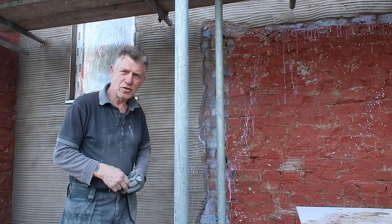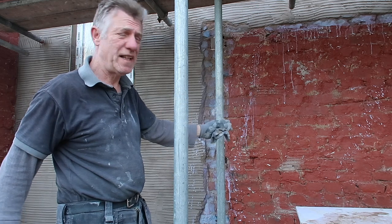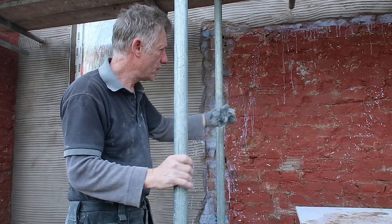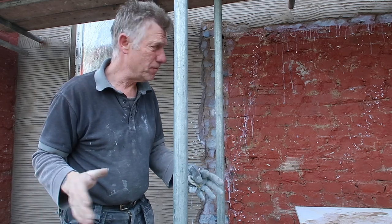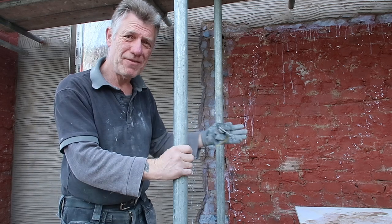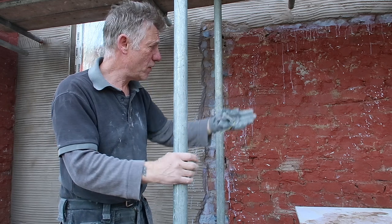Good morning YouTubers — on the property renovation of the old church. I'm coming down to the bottom now and this is a really bad area, it's all completely out. I just want to tell you about this special stuff you can put on the wall — it's got grit in it, it's kind of like a masonry paint that goes rock hard. I'm not going to say which company it is, but it is a special grip you can put on the wall. There are different makes out there but I'd highly recommend it, particularly for these old bricks — they undulate, they're in and out, all over the place. When you put the render on it, it just grips and holds it on; it just doesn't fall off even when there are indents in the wall.